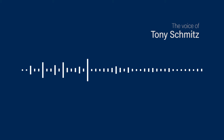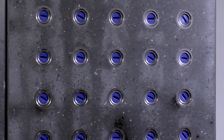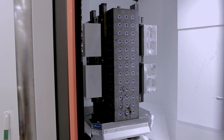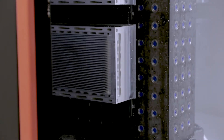If I owned a shop and I were going to make this decision, here would be the decision matrix that I would use. First of all, I would rule out the aluminum tombstone. Second, to justify the cost of the epoxy tombstone, I would be convinced that I could achieve acceptable machining performance relative to steel or cast iron. The trade-off that I would measure would be the reduced mass of the epoxy relative to the cost. If I could reduce the mass by 50% by going to the epoxy, I could justify maybe 50% more cost because of that mass reduction.